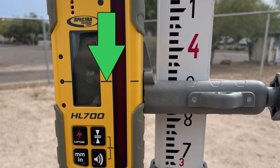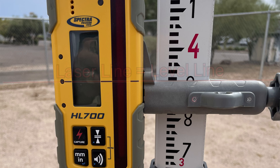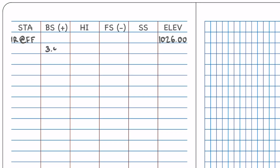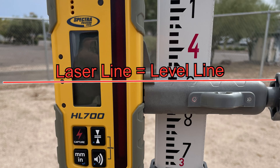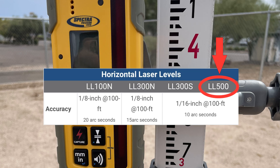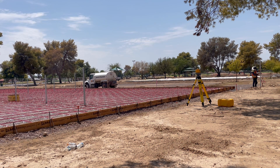I'll tighten the receiver and take my final reading. See how the horizontal black line corresponds with the top of the receiver bracket — the black line is where the laser crosses the receiver when it's at the same elevation as the level, and the top line of the bracket is where I take my reading. My backsight reading here is 3.91 feet. Note I'm not reading to the thousandths anymore; unlike a builder's level with a very tight crosshair, the laser level beam operates at around 1/100th of a foot accuracy, and even that is the higher-end, more expensive version. Always read the manufacturer's specs to find out how accurate your equipment is.